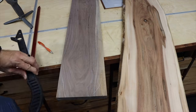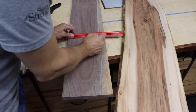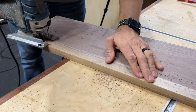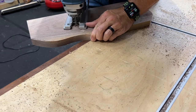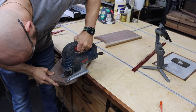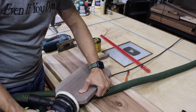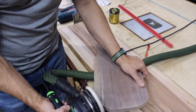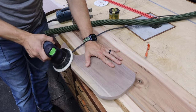To start off, I'm just gonna use this push stick off my table saw and design the handle shape. I measured out about 14 inches and drew the rest of the shapes. Then I just take my jigsaw, go slow, and cut out the design that you previously marked. Once that's cut out, I used my orbital sander and 80 grit sandpaper to sand the whole thing. I went around those radiuses and smoothed those out to make it look a lot better — it gets those saw marks off and makes them look more uniform.